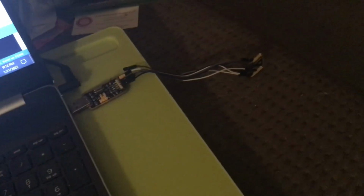And there's one more thing I want to show you we can do with this weird controller. Now there's a chance that my board may be defective, but it stays in program mode for only 9 seconds. You might have a different experience with your board depending on where you get it from or how it's manufactured. I don't know why mine does that, but I am able to keep it maintained. I keep that wire powered and keep pushing the reset button.